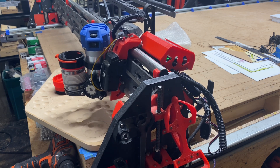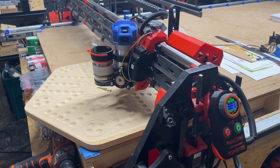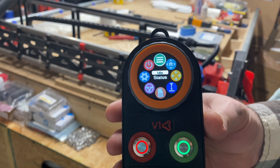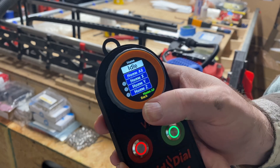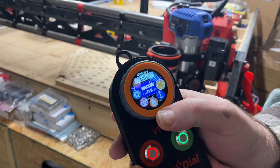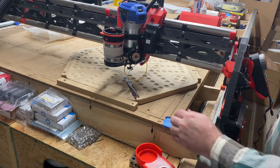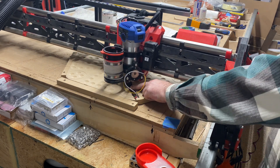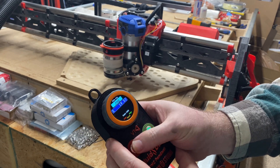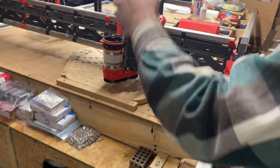So I'm doing an air cut with it now, with it up in the air. A long time back I made a CAD/CAM error setting up a full-sheet cut job in which I was making some game boards. When I flipped the full sheet over to cut the other side, it wasn't indexed properly from top to bottom. So the game boards had one side usable — the divots aligned with the profile cut — and the other side was not usable. The divots and pocketing were not properly indexed with the profile cut.